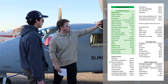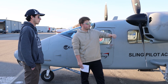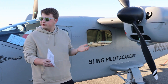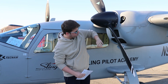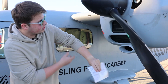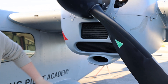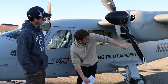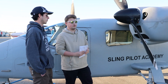We're also going to make sure that the actual prop spinner itself is secure and on. From there, I like to check our radiators. There's not much we can check with this engine — there are no cowlings we can pop up, so we're kind of limited as to what we can look at. But we do want to check the condition of both our radiators: the oil radiator on top and the coolant radiator. We want to make sure everything is all spaced out, no FOD, no bugs, anything like that. Same thing with our coolant radiator and finally the air intake down there — it's all clean. Always check those and make sure there's nothing blocking it.